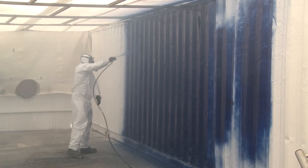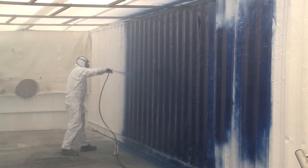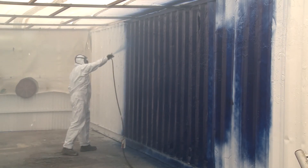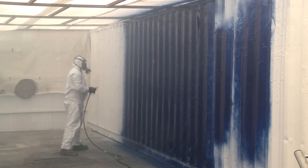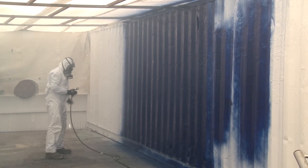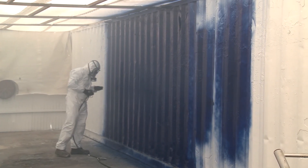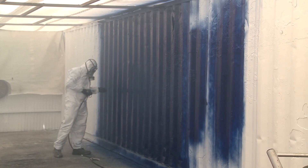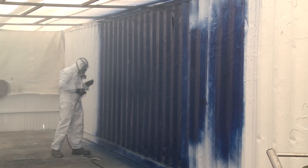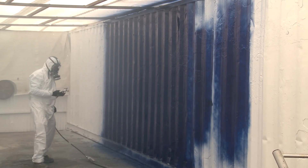If he stops and starts, you'd get lost and wouldn't know where you are in relation to the application. So there you go — that's a topcoat polyurethane application. Now if that were an epoxy primer, I'd be a lot slower in application and I'd use a far bigger tip — you'd be up around 20, 21 to 23, even 25 — depending on the viscosity and the volume solids of the product itself.